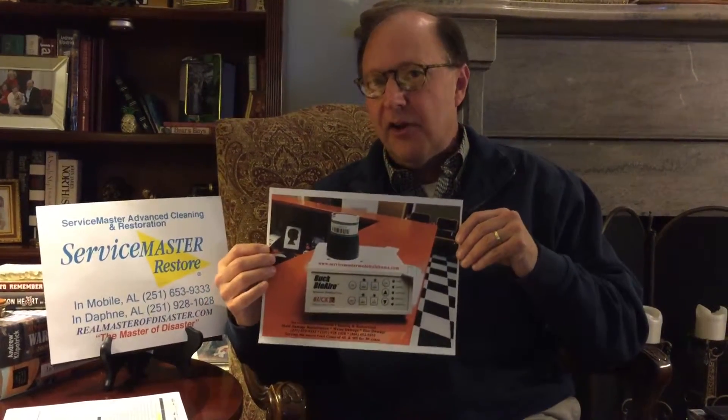That's what we do. When we see a widespread mold problem, we call in an IH, and they bring out a machine that does air sampling. From that, they get a report — this is the before report — and it basically shows you the spore count for every different type of mold that you might have in your home.